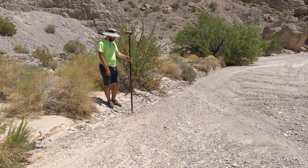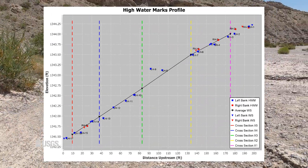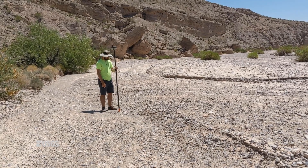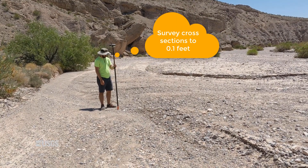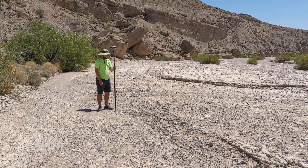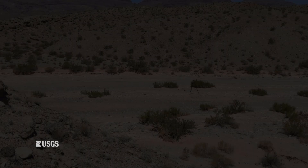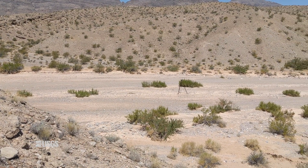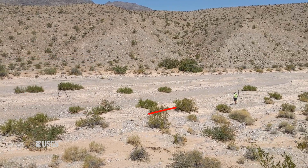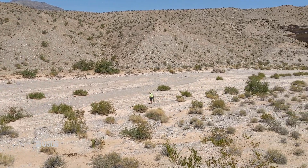Now I'm going to move on to talk about surveying cross sections. This assumes you have already plotted your high watermarks in the field and determined the cross section locations. Cross sections should be surveyed to the nearest 0.1 foot. Data loggers that we use with our instruments often log to 0.01 or 0.001 feet — while this exceeds our convention, we can accept the excess precision and round the values later if necessary. Cross sections should be surveyed perpendicular to the flood channel. Be careful — your low flow channel may be at a different angle than the flood channel, so visualize the flood and make sure your cross sections are perpendicular to those flow lines.